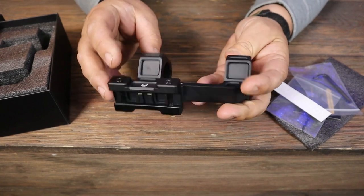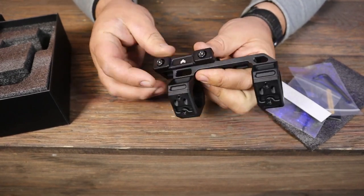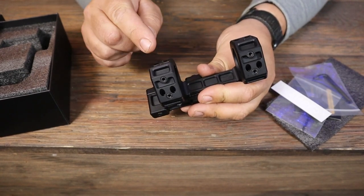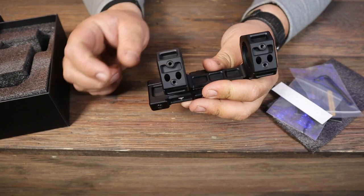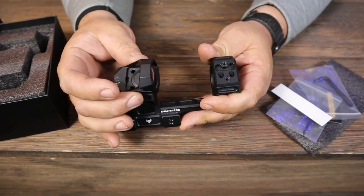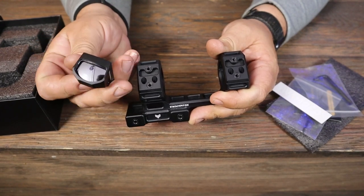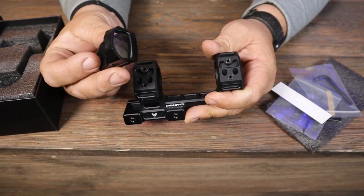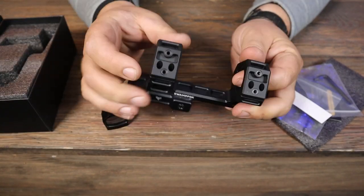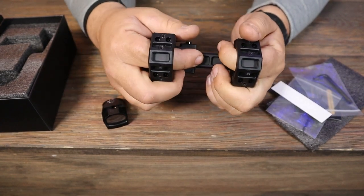It's a very nice mount made out of 7075 T6 aluminum, anodized in matte black. It's skeletonized a bit to save weight. It mounts with T25 torx screws and the scope rings use T10 torx screws. One neat feature is that you have options for an offset red dot — the screw pattern is RMR compatible, so anything like a Trijicon RMR, Swamp Fox Liberty, Justice, or King Slayer will mount perfectly on here.